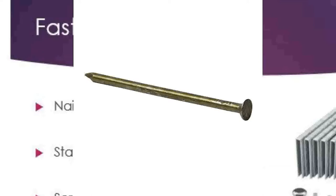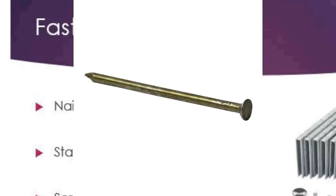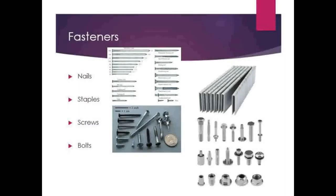We don't really see nails used a lot. You might see them used in props to keep consistency with time period, but usually now you're going to see more staples and screws. There are three different sizes of staples. The crown is the back edge of the staple. Narrow crown staples are approximately a quarter of an inch. Medium crown staples measure approximately 7/16ths of an inch. And wide crown staples can measure approximately one inch. You can actually use a wide crown to span a gap and hold two pieces of wood together, as long as you can staple from both sides.